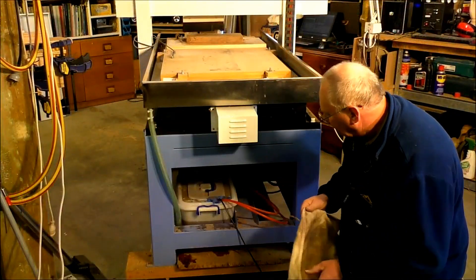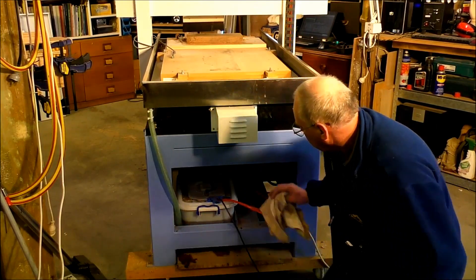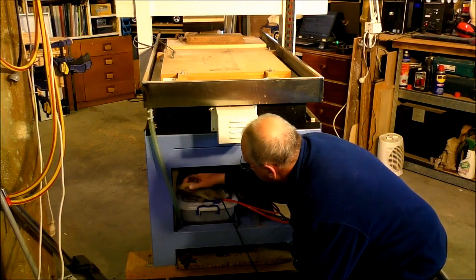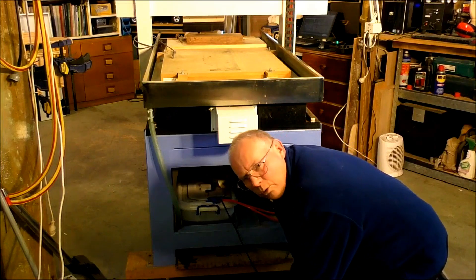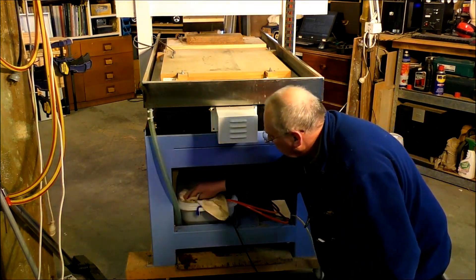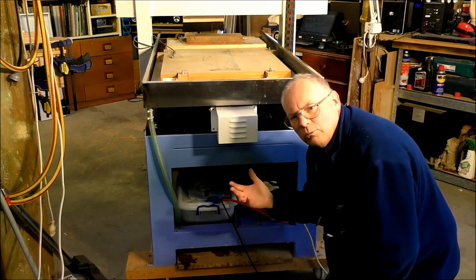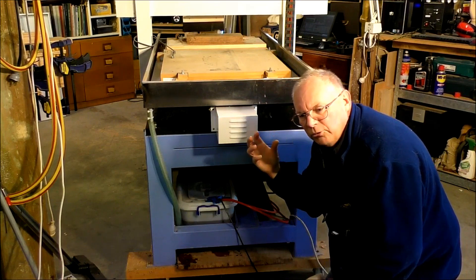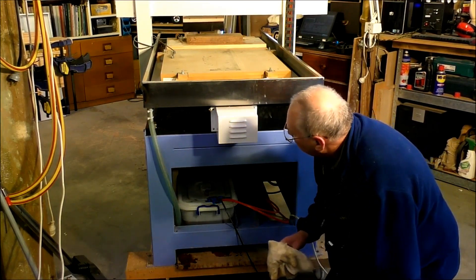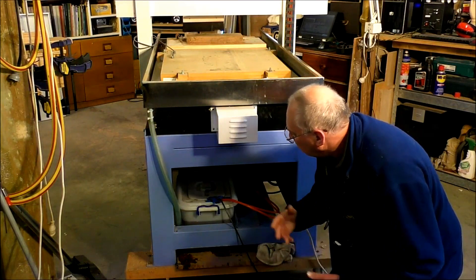I don't suppose you often get to see the back side or the internals through the back of these machines. Let's just clean some of the dust and debris off it — I don't want to get that in the coolant. It is coolant too. I always mix ethylene glycol, not only to stop the water from freezing, but to stop any corrosion inside the spindle, because the spindle is made up of stainless steel and aluminium parts inside the coolant galleries. So I put ethylene glycol or similar in there.